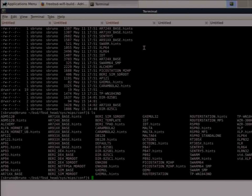So the base system, these guys right here are the Atheros, this is what this reference platform can actually do. These are all of the things in it: this is where the Atheros Ethernet switch is, this is where the Atheros wireless is, this is what usually the flash looks like, it's the default. And then here's the reference board that you could get as an Atheros developer. And then these are two that I've been messing with. This one here is actually that one that's over there. Here's the TP-Link that's cut off. That one, quite a few people have had good success with.